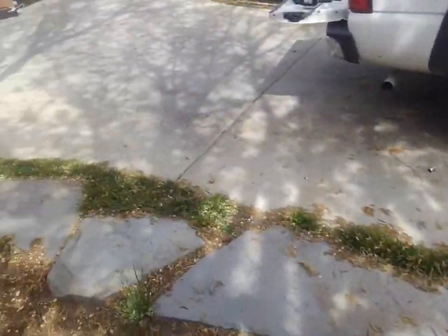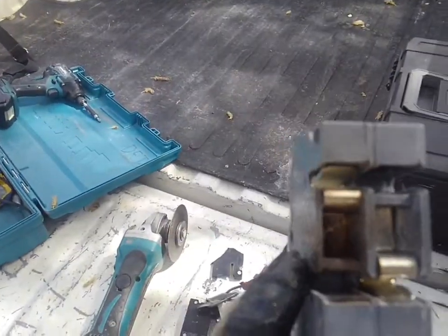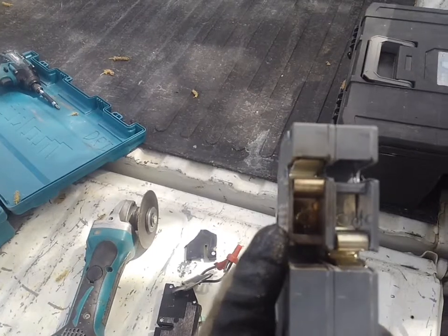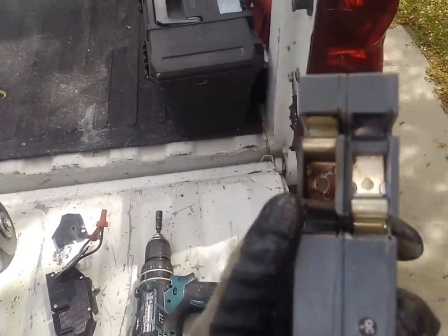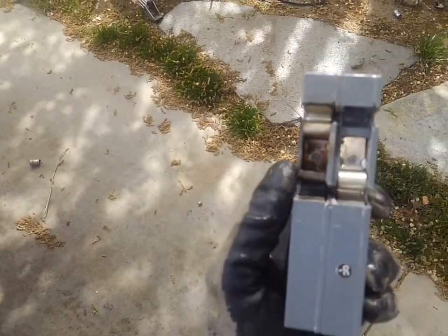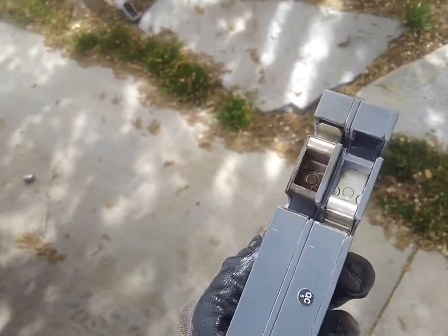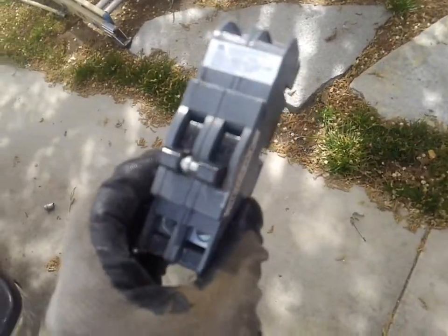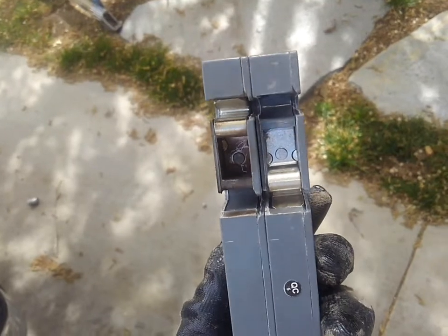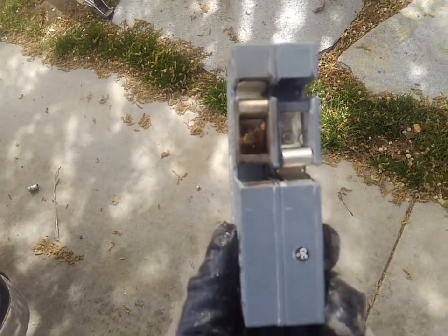This is a good one still. Our main, which was a 100-amp, was pretty fried. This is the circuit breaker itself — this doesn't have anything to do with the bus bar. You see that rivet there? That rivet is loose, causing this circuit breaker to heat up. This was a relatively new circuit breaker — this was the main coming in.